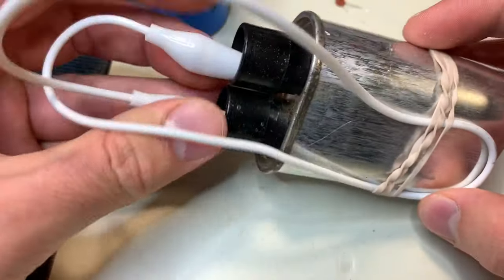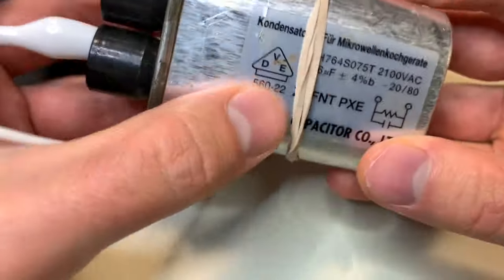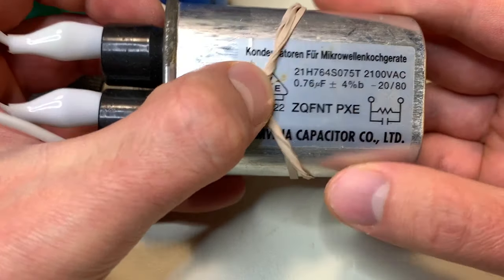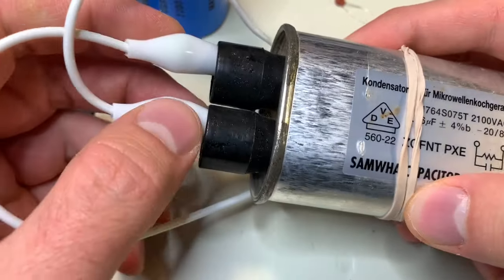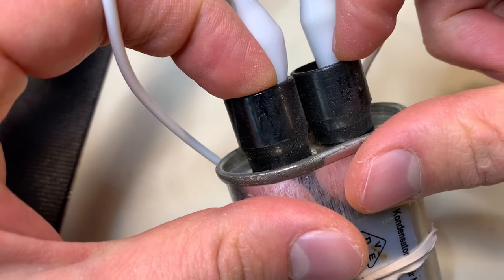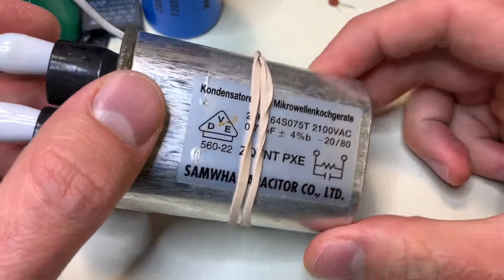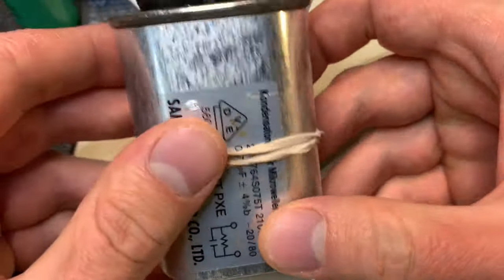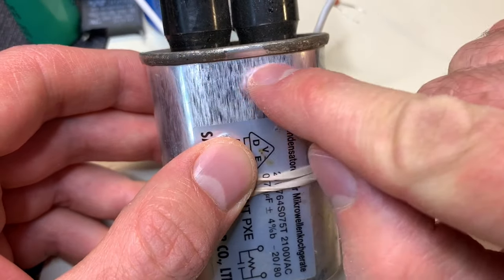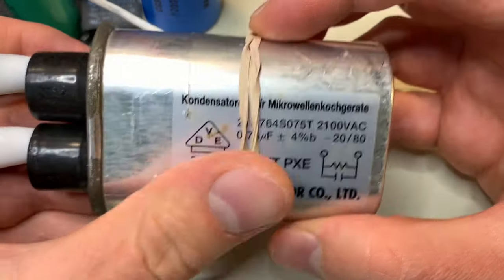But when you start getting into the really dangerous capacitors, they start looking like this. You can see here I have the two terminals shorted out permanently. This is actually a capacitor from a microwave oven, and this capacitor is rated for 2 kilovolts. The truly dangerous thing about these is not only can it potentially shock you and cause burn damage or nerve damage, if you touched one terminal with one finger and the other terminal with the other finger, it's going to send 2,100 volts through your chest and potentially through your heart. One feature of these very large capacitors, usually, is this symbol here — it has a capacitor and a resistor on top of it. What that means is that inside of this can, there's a resistor and a capacitor, and then there's a resistor shorting out the two leads, so when this is removed from power it will start slowly discharging itself to make it relatively safe.